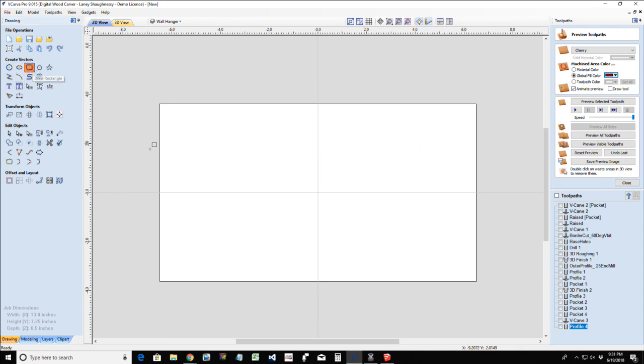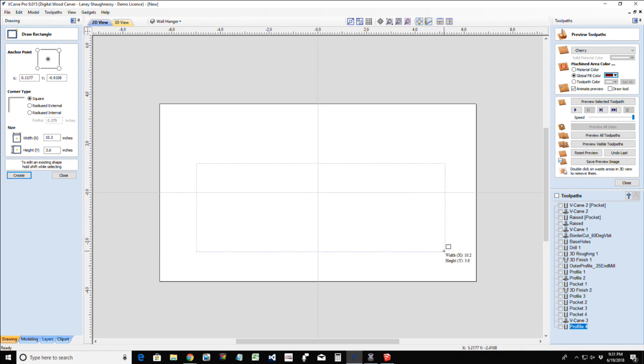All right, so for our wall hanger, we're going to have our back plate. Now on the back plate, I want the size. A typical paper towel roll is about 11 inches in length. Depending on the size of my material, I'm going to have two side pieces where my roll is going to be between. If I have 3/4 inch on each side, that's an inch and a half. We want to make sure that we size our holder properly. So 11, I'd like to add in that inch and a half, hit my equal sign, and then I want to give myself some room.